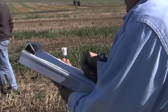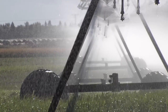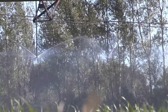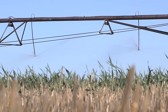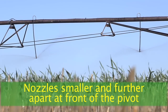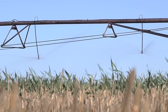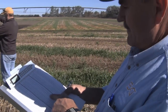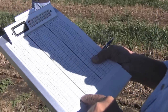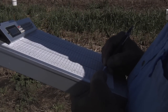Some readings are at 155, which means some other part of the field is probably getting less water — and we'll probably see that as we get closer to the pivot point. You can see out here the spacing is about 10 feet, then it transitions to 20 feet — that's where we'll start seeing readings go below 125. We had this group go from 120 up to 190, then drop to around 160, and now we're down to around 110 and 75. We definitely know there's a mismatch in the sprinkler system.